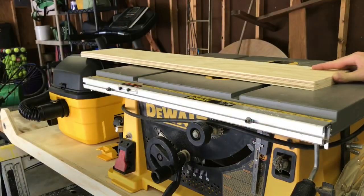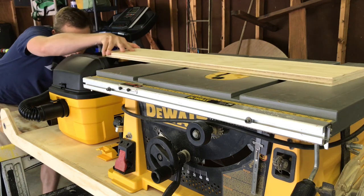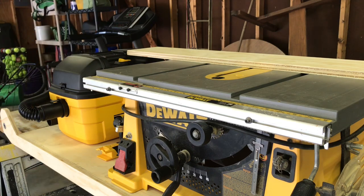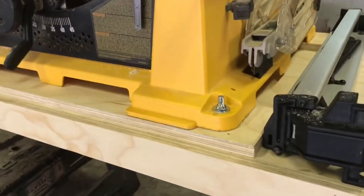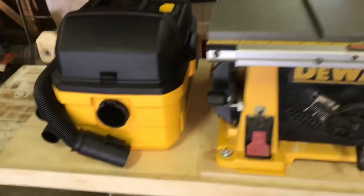This new Dewalt shop vac was about a 1/4 inch too tall for board clearance across the table saw. I really wanted everything to be stationary here, so I saw an opportunity to solve two problems at once. I decided to mount the table saw to its own cleat system, which could then slide into brackets on the platform. This would keep the table saw secure, but also make it removable, and it would create height clearance for the shop vac.